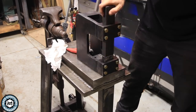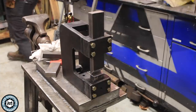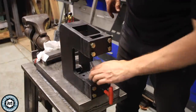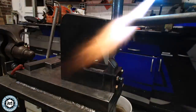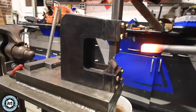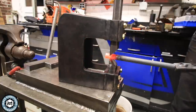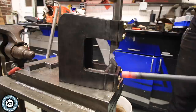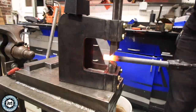Now we're on the striking anvil — I'm going to give this a try. I was out of propane so I decided to try it out with my rosebud on my torch. We'll start with the butchering dies. I noticed it was a little hard to keep things even — I was tilting the material, causing the dies to meet in an uneven spot — but it still did a really quick job of adding this sort of harsh shelf into the material. I'm grabbing a three-quarter-inch round bar.